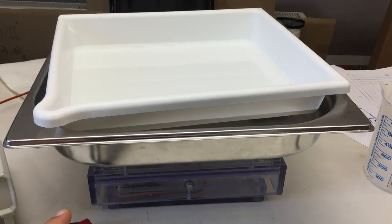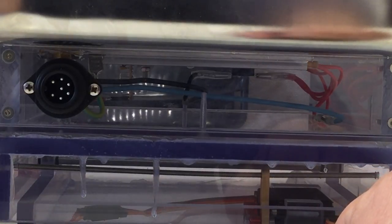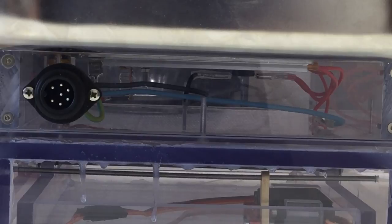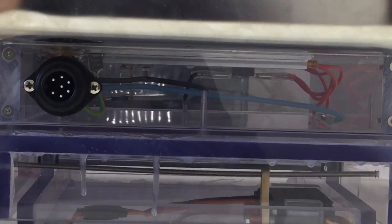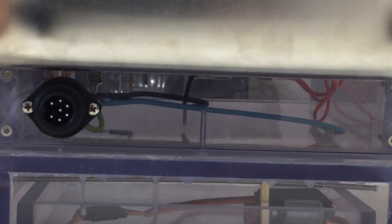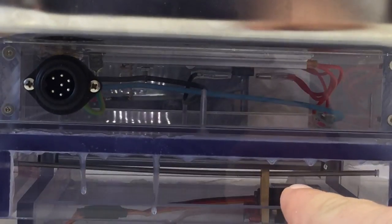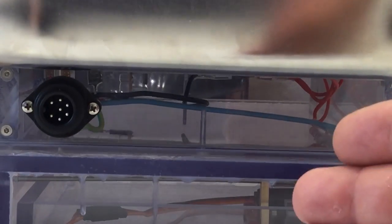Yeah, let me show it to you. Okay, you should be able to see now if I switch the whole thing on again, how that M3 rod is really flexing. Maybe if I increase the stroke again. Yeah, there. And that's not good. More speed. Yeah, just for the fun of it. You can really see how it's, yeah, that's 5 millimeters, 10 millimeters flex. That's too much.